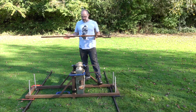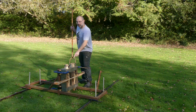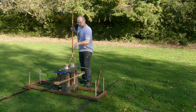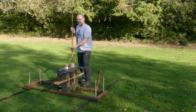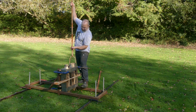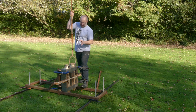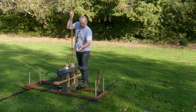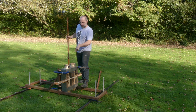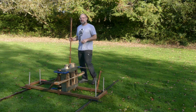This is the bar — the lever I used to tension the cords. It goes on the bottom; you tie off your cord on the first loop on the bar, bring it up, pass it over this peg, and lash it on these cleats. Then you push it forward and the relationship of these components stretches the cord as much as it wants to stretch. Then you clamp it off — we don't know how the Romans did it; I did it with a modified G-clamp. You clamp it to keep that tension, take everything off, turn it the other way, thread the cord back through, and go again. Took two of us a day to do this — a very laborious process.